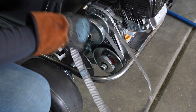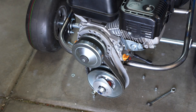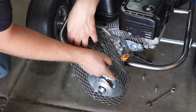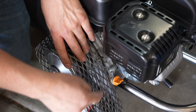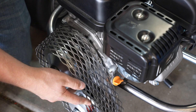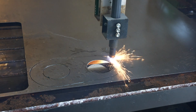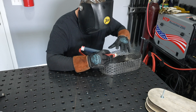Because of the close proximity of the brake rotor to the torque converter I had to pull the engine off and turn it sideways to test fit it. It looks like it fits on really well, and I was expecting to make some mounts for the inside but the holes actually line up with some of the expanded metal, so I think I'll be able to just hold it on with some screws and washers directly. I drew up a side plate that I'm cutting out on the plasma table, and it's going to be a little bit oversized so I can match fit it directly to what I ended up with on the form.